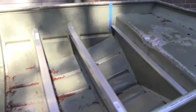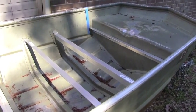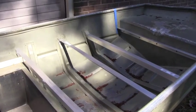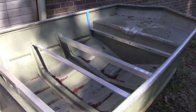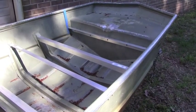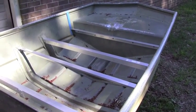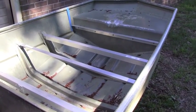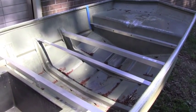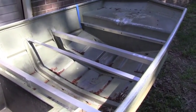I won't have any supports going down to the bottom of the boat — it won't be necessary. One thing I always want to consider is strength in the sides of the boat when you're building decks. If you incorporate all of that, you don't have a lot of issues with having to put center supports all the way down to the bottom of the boat. It leaves you a lot more room for storage when you're building hatches and the like, and you don't have to dodge them.